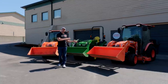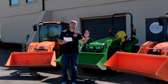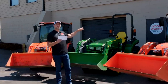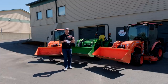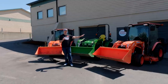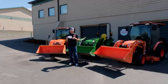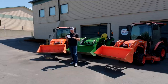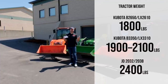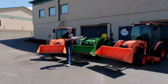Let's talk dimensions, weight, and tire size. Comparing open-station models, there's about a 400 to 500 pound weight difference, with the John Deere weighing more. The John Deere 2032R or 2038R weighs about 2,400 pounds. The smaller Kubota variants — the B2650 and LX2610 — weigh around 1,800 pounds. Going to the B3350 or LX3310 gets you up to 1,900 to 2,100 pounds — heavier, with a bigger tire, but still significantly less than the John Deere.